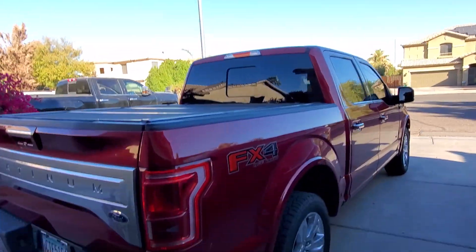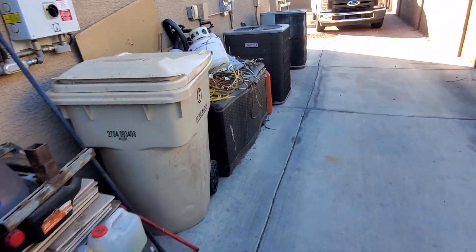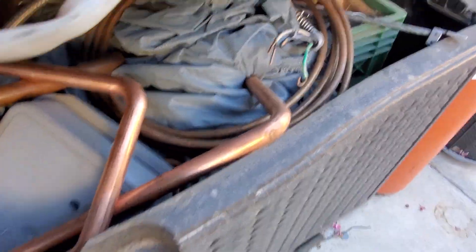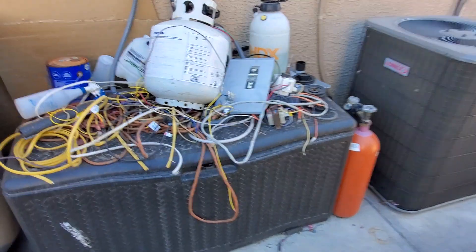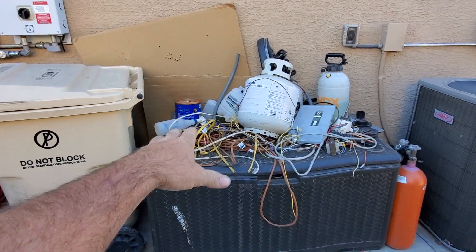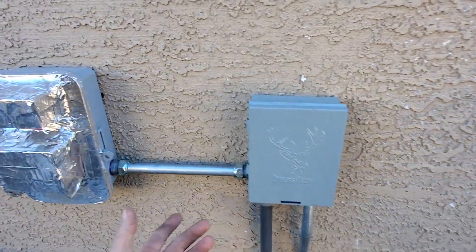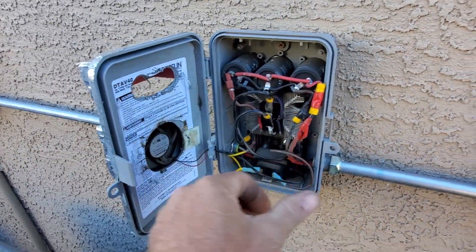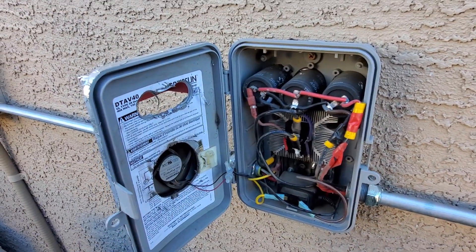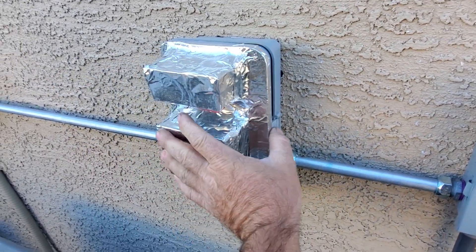The sun's already gone past this area, so it's definitely warmer out here than it is in there. I've got to really tackle this mess and get it cleaned up — this is just where I've thrown stuff as I've been working on projects. I have all sorts of parts, copper and everything in there. This unit here is my VFD-driven three-phase compressor that I have assisted by solar power, which a lot of you have seen. My external rectifier feeding the variable frequency drive has made it without frying all summer. The fan is still working. I actually have a diode H-bridge block to replace this with if I want — scored one the other day.